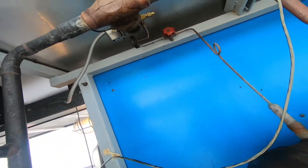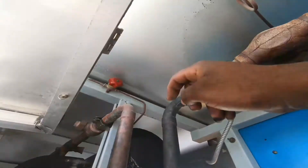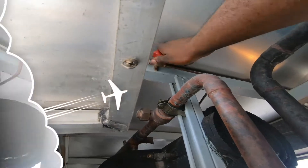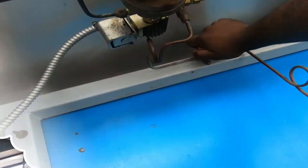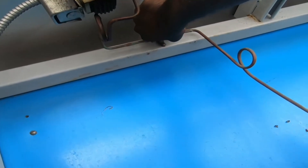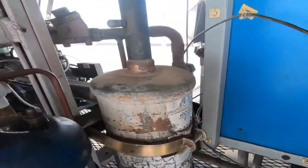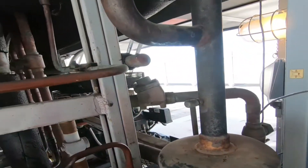We've got some pilot lines up here also. Let's valve this off - there's another one right here, valve this one off. So we've valved off our compressors, valved off our condenser supply, valved off our hot gas header. Basically you just want to isolate this - going back that way is our compressors, that's what we valved down, so we're good on that.